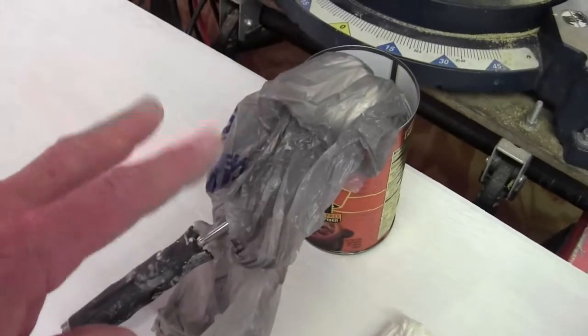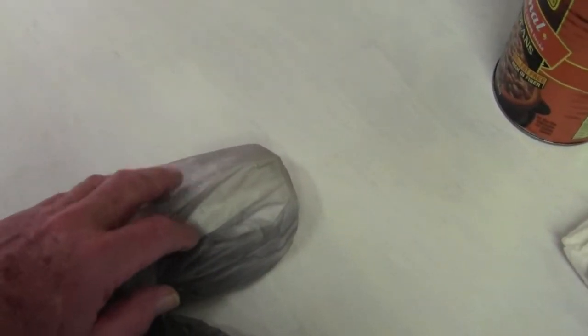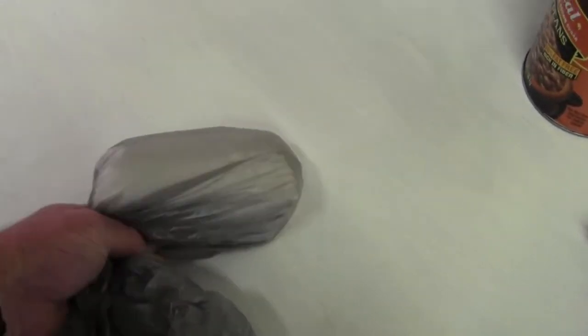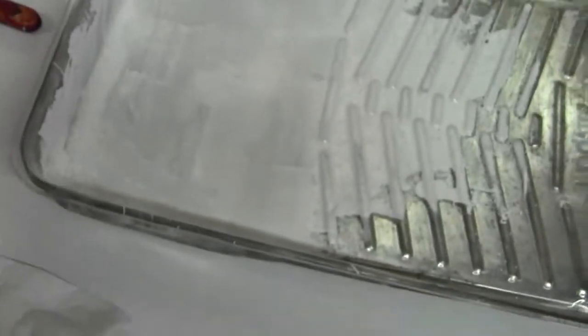For oil-based paint, you have to do it with thinner — you don't want to breathe the fumes off the thinner, so store it somewhere ventilated. You'd roll the roller up, put thinner on it, and wrap it around tightly. The next day you unroll it and keep painting.